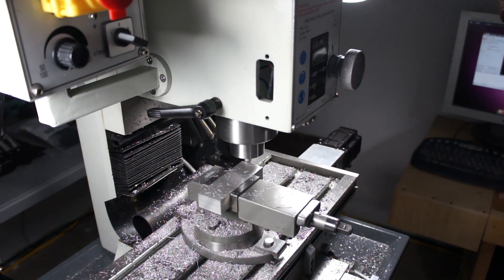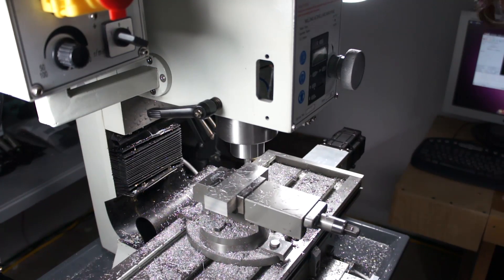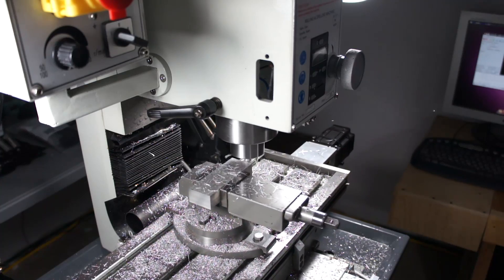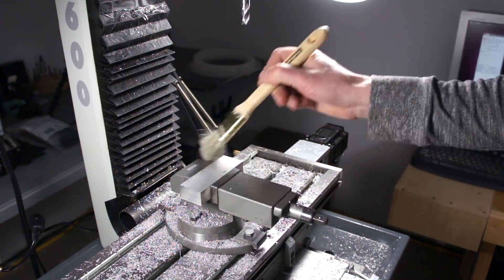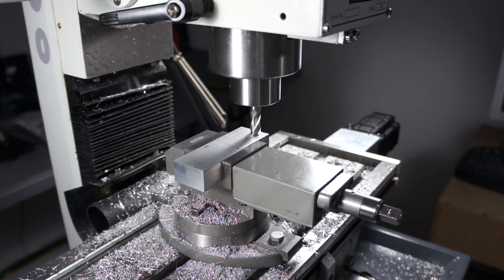If I move it half the width obviously I'm right over the center of the part. So move to the other side, clean it up to 3.5 inches and we're done. This is not an ultra critical part — you could honestly do this with a hacksaw — this is just more for visual appeal and to get my next dimensions so I can work off a fixed dimension. Checking it, I was about two thou off, which is more than enough for this purpose.